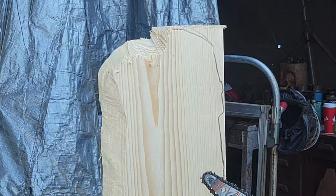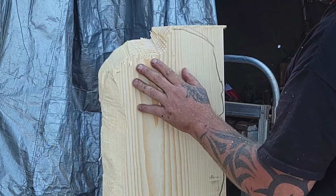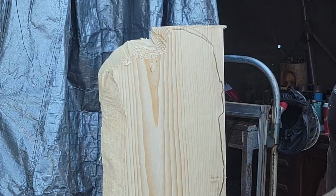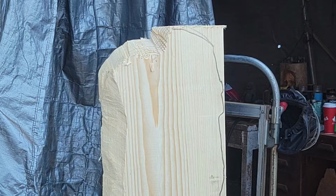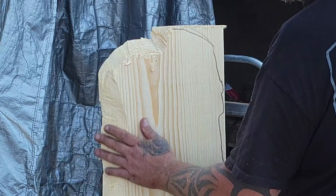Can you notice how I beveled this? Because you're going to see this grain later. This is a shou sugi ban, so this stuff's really going to pop out later. It's a lot more work to make this piece go like this and sit on the stump. But anyways, I'll get all this cut out. And like I said, you could use a jigsaw, because you can make this bevel later with a grinder with a sanding pad. I'll show you. Okay?